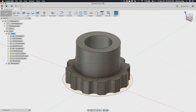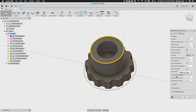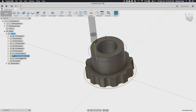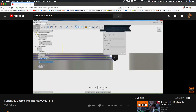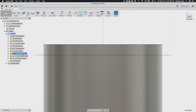Most of the CAM for this project was stuff I've done before: face my cylindrical stock material to the desired length, adaptive clearing away 99% of what needs to go, use contours and pockets to true everything up to final dimensions, and then 2D chamfer my top facing edges. NYC CNC went way deeper into chamfer operations than I did in my 2D chamfer video, and it's worth a watch. I could have used a contour toolpath with multiple stepovers for this top chamfer instead of making two progressively deeper 2D chamfer toolpaths.